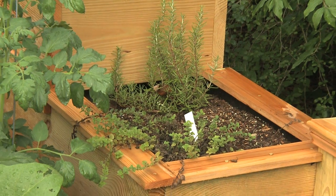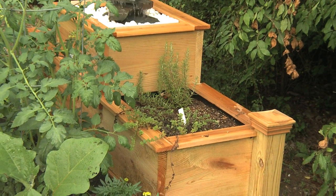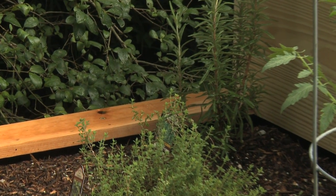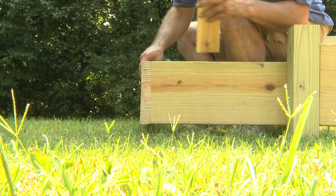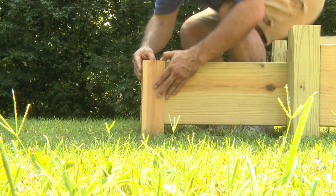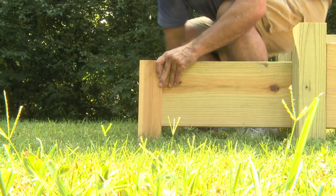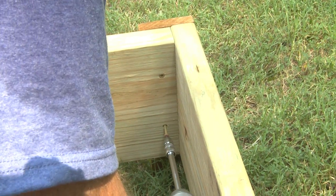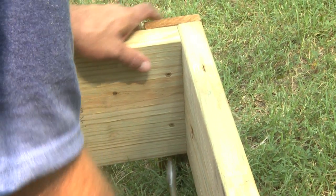We'll use Western Red Cedar 1x4s to trim out the bed as we install the landscape fabric. The trim not only gives a more finished appearance, but it provides a small shelf or seat when you're working in the garden. Start by cutting the corner supports for the side beds. Like the 4x4 posts, these can also help support the outer edges of the bed if the land is sloped. Align the top of the support with the top edge of the bed and fasten with screws from the inside.